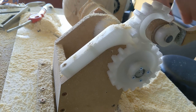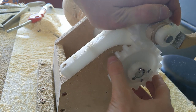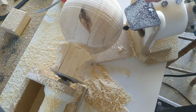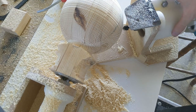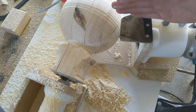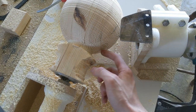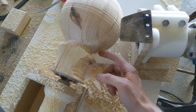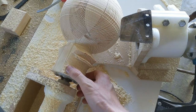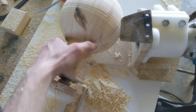Although I'm not sure how much it's helping, because there's a bit of backlash in there, you can kind of see. This is actually mounted a little bit off-center, so the pivot point is directly underneath the center of the sphere, obviously. But the router arbor is mounted 40mm over to one side. The reason for that is it gives you slightly better reach in here, so you can make this diameter smaller. I think I could go smaller still if I had removed some of this stock on the bandsaw before I started, but as it is that's plenty small enough. I'm happy with that diameter.